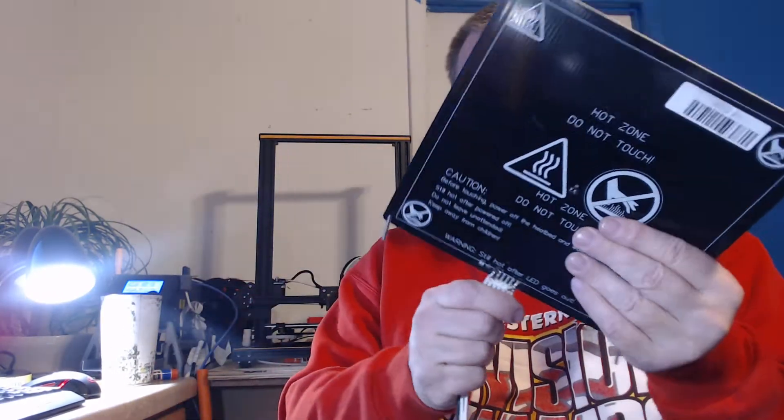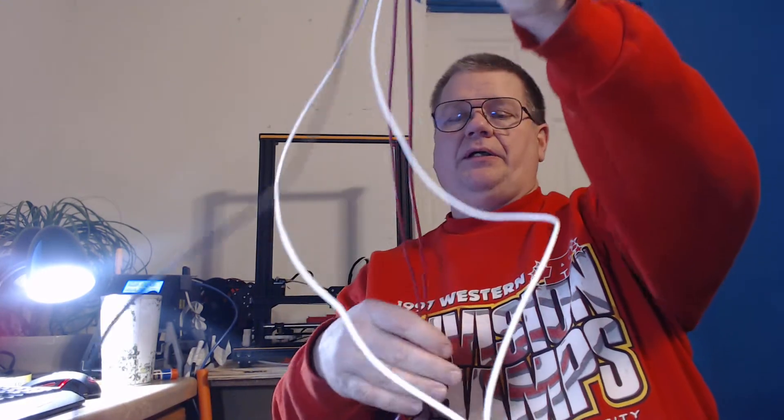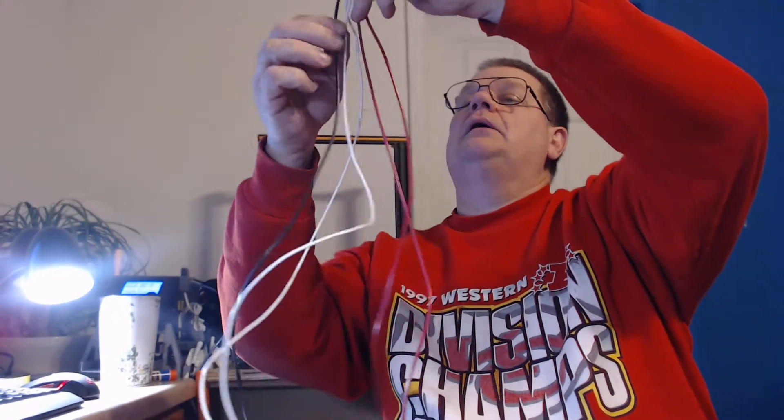The wire doesn't fix the problem because it's in the connector. The way to fix the problem is one of two things. This plug right here is designed for 10 amps per connector — not for the entire plug — and there's a 12 amp capacity requirement. So if you have the crimpers to put these ends on, you can find these ends and put two extra wires in here like so, and run these to your power supply one right next to each other.